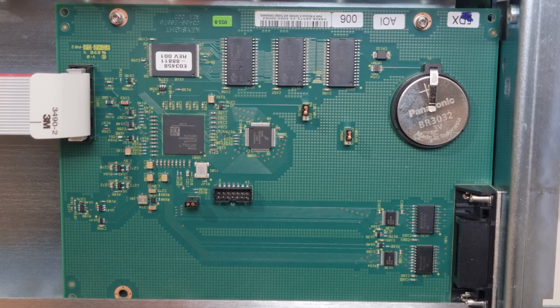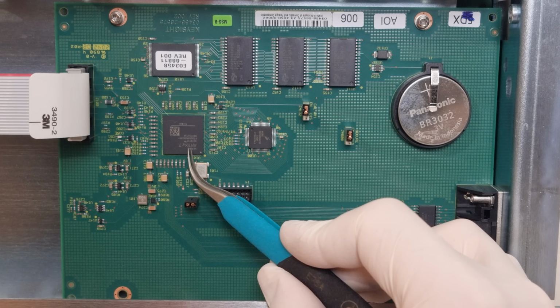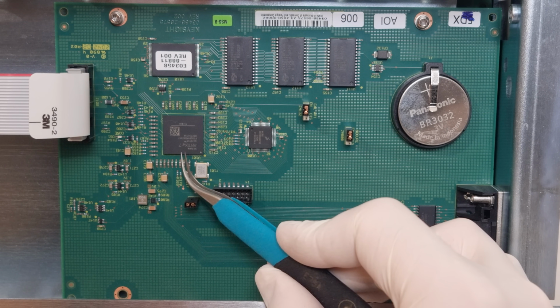First of all, we've got a brand new OutGuard logic board that replaces 20 or so power-hungry integrated circuits with one Artix-7 FPGA and a few requisites. First, I thought they had also implemented the 68000 main processor in there as a soft core maybe. The Xilinx would be able to do that with ease, I think. But on closer inspection there is a regular hard-core 68000 in a QFP package sitting right next to it.